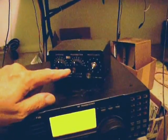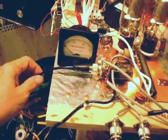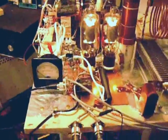I'm driving it with an ICOM IC718 — this probably looks familiar — with the MFJ antenna tuner for the input match to the amplifier. That hooks up right here on these two BNCs. The input from the radio goes here, and then of course these cables go to the antenna tuner. The antenna tuner serves as an input match to the 572Bs.